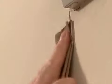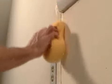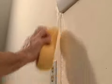After you've widened the crack, blow or vacuum out all the loose material. Lightly sand the surface of the wall with 120 grit sandpaper to roughen the surface surrounding the crack. Dampen the crack and the surrounding area. Moistening the area keeps the filler compound from drying out too fast and cracking.